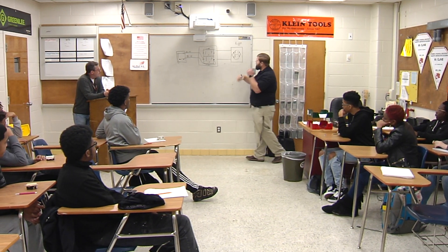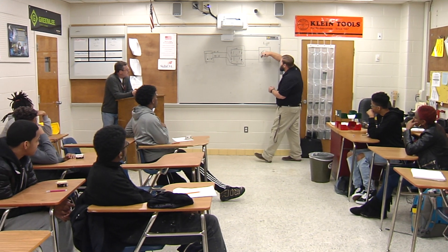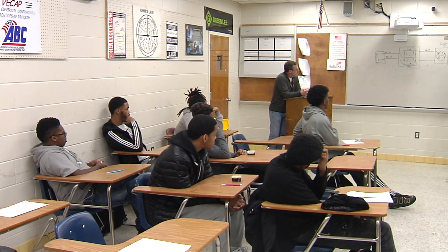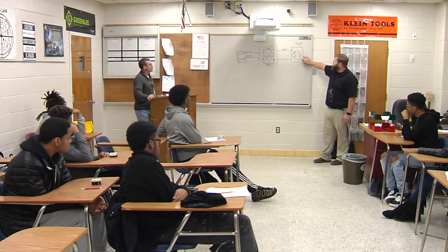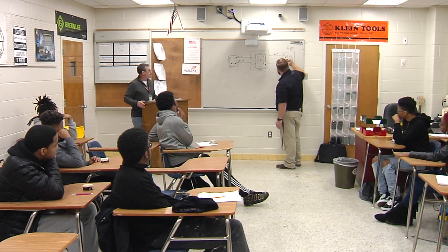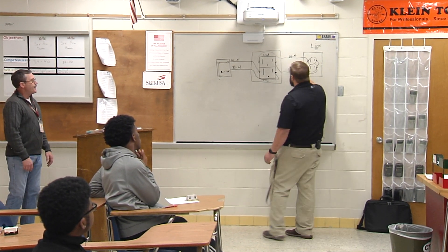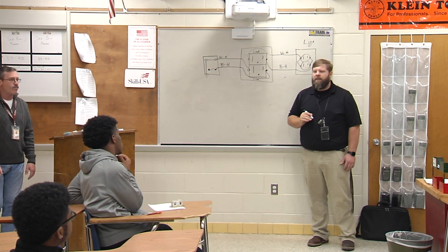So neutral — what side would the neutral go to over here on the downstream receptacle? Left side. Does it matter which one? Why not? Because of the tab. The tab is in place and so the power continues to flow. Color is white, purpose is neutral. Now I still have to get a hot wire — where am I going to come from? I want this protected, so come from the load side. Does it matter which position since the tab is in place? No, because of the tab. Color is black. Would the purpose be the switch leg? No, because there's no switch.